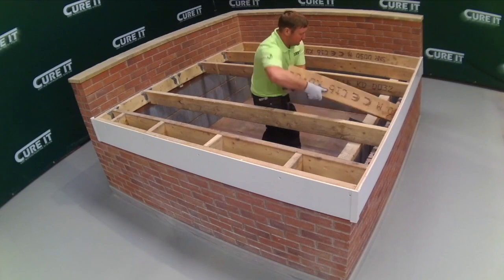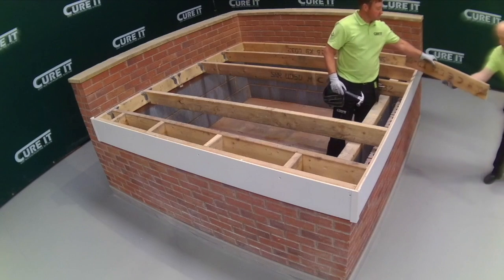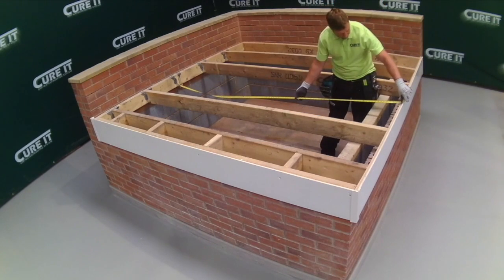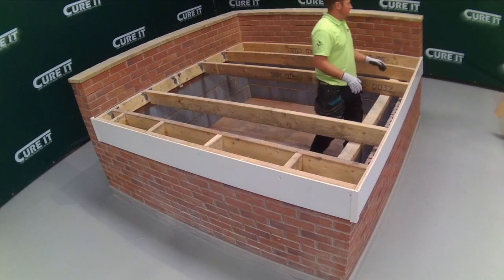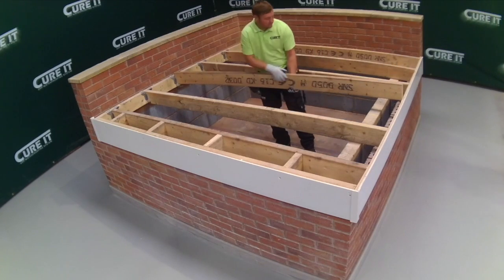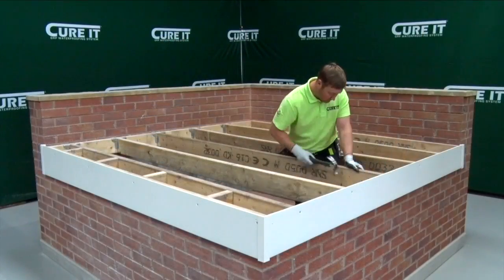To prepare for installation, replace any damaged joists and install noggins where required. Noggins are recommended to remedy any play in joists and to provide extra reinforcement for wider or loose joists. The maximum span between joists is 600 millimeters. Consider the insulation and ventilation at this stage along with whether the fascia and guttering should be replaced, though this should be done before the decking is fitted.